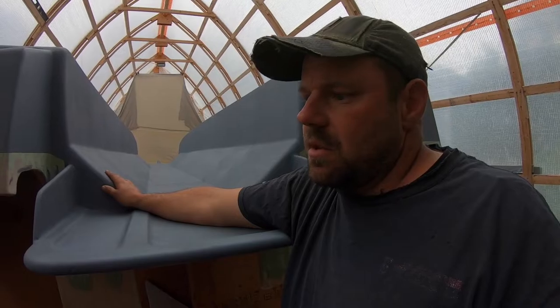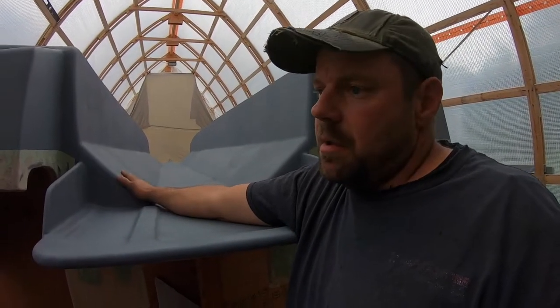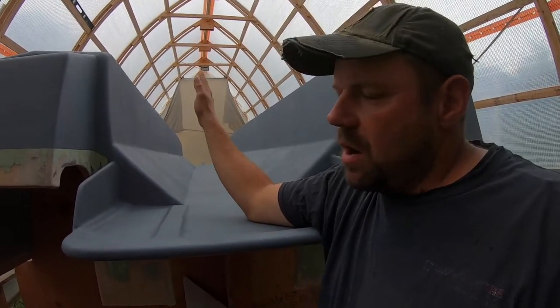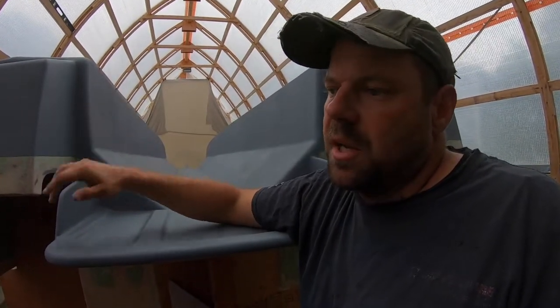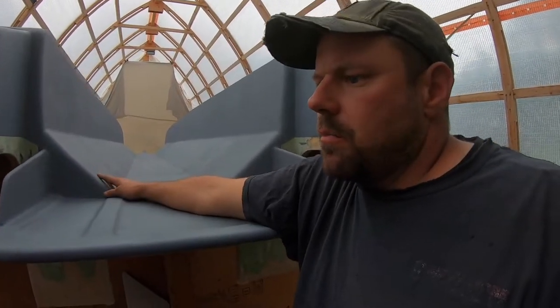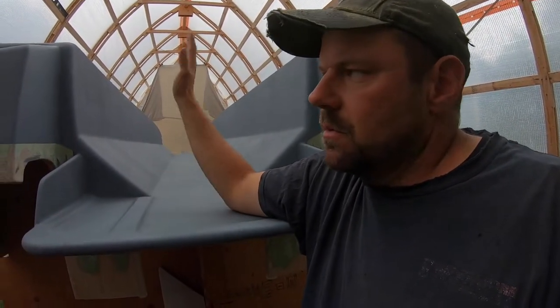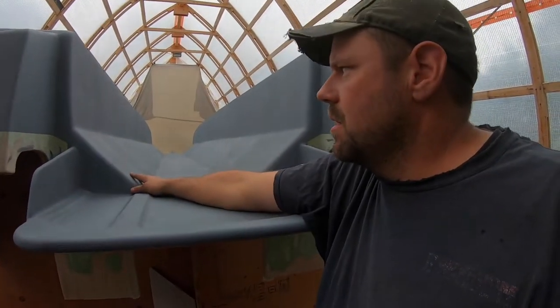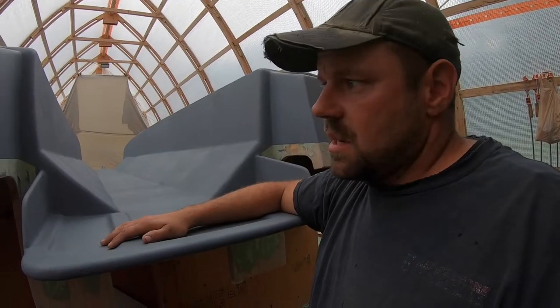I only have a few hours every night to do this. A few sanding tips I've been told: don't go near the corners with the power sander — you'll burn through the primer or whatever you have on pretty easily. Stay just shy of the corner and lightly hit the corners by hand with a piece of sandpaper. It's easier to work your way up the grits — sand everything at 180, step up to 220, then up to 320 or 360. That's the method we're going to use. Thanks for watching — be sure to like, share, and subscribe.